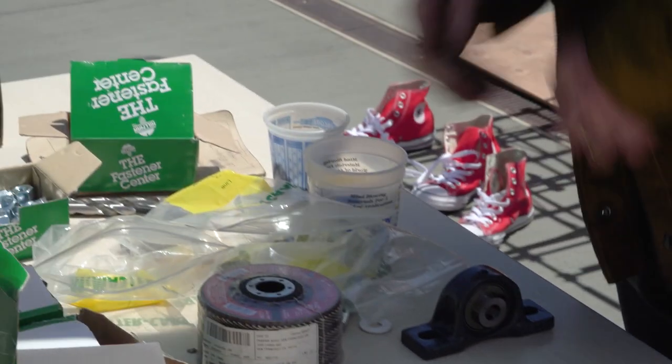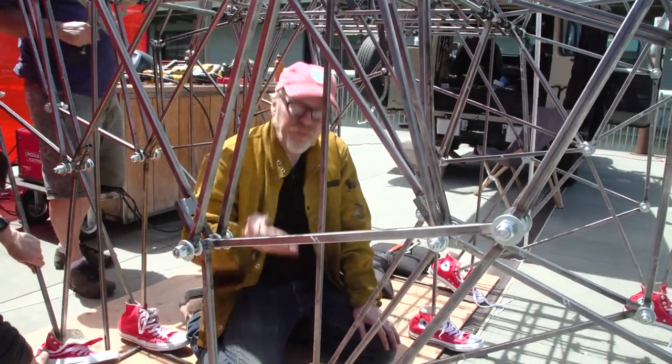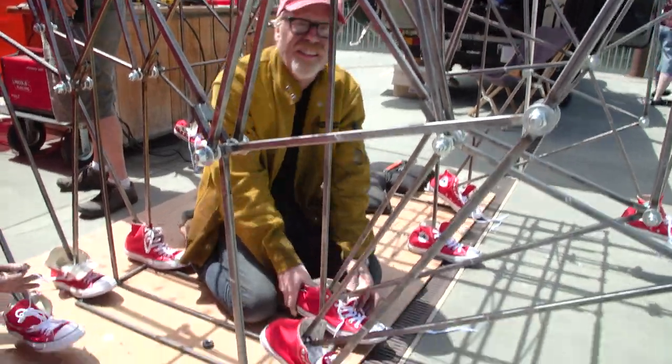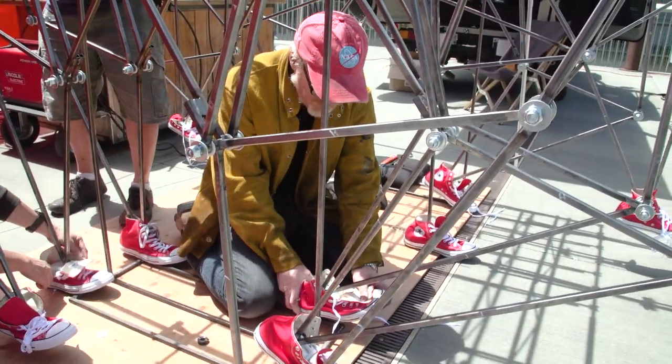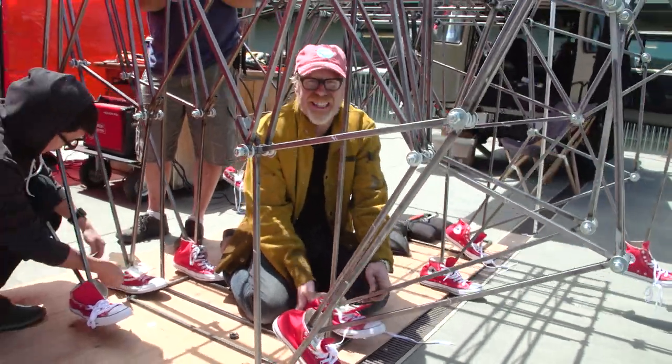Now I said that Theo had given me two great pieces of advice. One was to make the spine rigid. The second was to allow a little bit of play in the feet when they hit the ground. And so I have done that. I've put in a little piece of UHMW bearing material and I've allowed the foot to have about 2.5 inches of slide each time it lands.